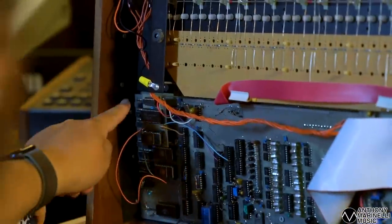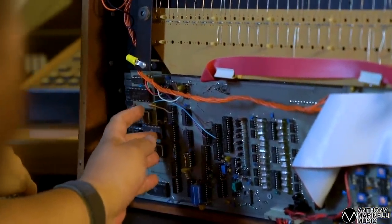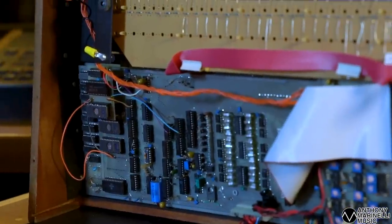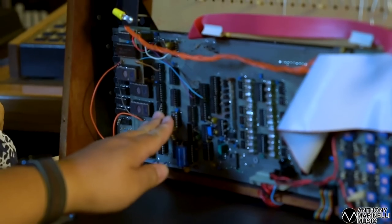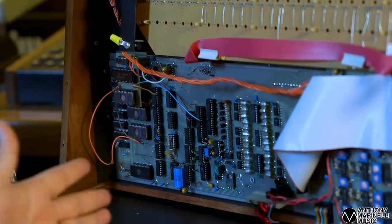Whenever you save a program, it's saved onto one of these chips, and those chips fail all the time. And here are your three ROMs - these are where the actual software is, so you could update it later if they fixed any bugs. There's scratch pad RAM somewhere too - that would be noting the actual real-time scratch pad, like the manual mode essentially. You have interfacing stuff here which interfaces with all this to assign chip enables for these various chips because they all run basically in parallel.